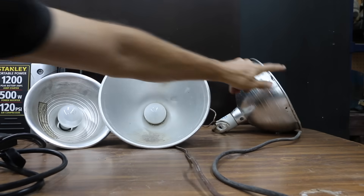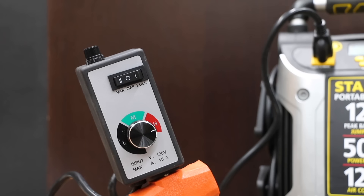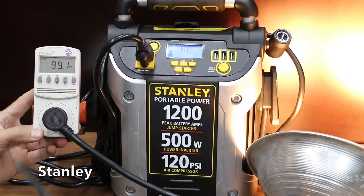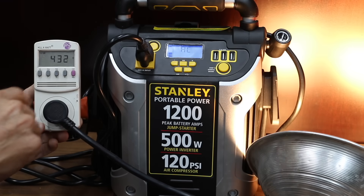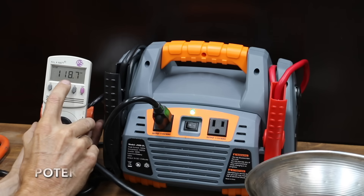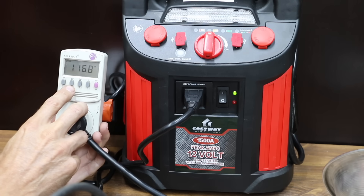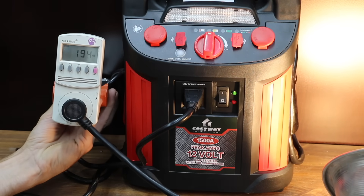Next, let's compare the performance of the power inverters using a couple of 100 watt bulbs, a 250 watt heat lamp, and a 500 watt halogen light for a couple of the brands. I'll use a fan speed controller to dial in the maximum current for each brand, beginning with the Stanley. The kilowatt device will track the electric load. The Stanley is around 122 volts without a load, rated for 500 watts. It easily handled incremental power increases but ran into problems around 450 watts, peaking at 477 watts very briefly — not quite 500 watts but fairly close. The Potec is at 118 volts without load, rated for 300 watts, and actually exceeded its rating, making it to 337 watts briefly before powering off from overload. The Cosway is at 117 volts, rated for 200 watts, and came very close, making it to 194 watts.